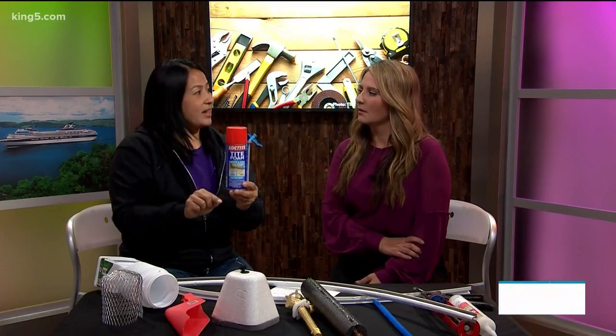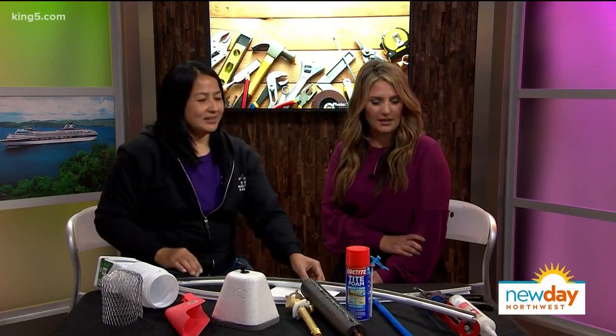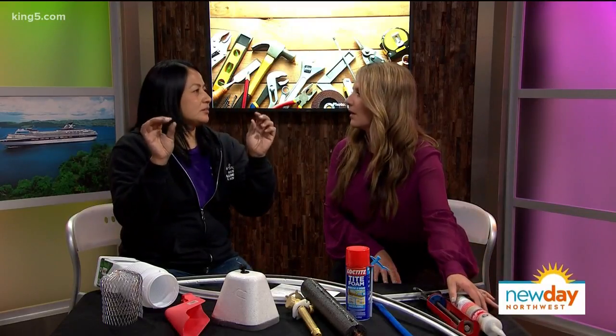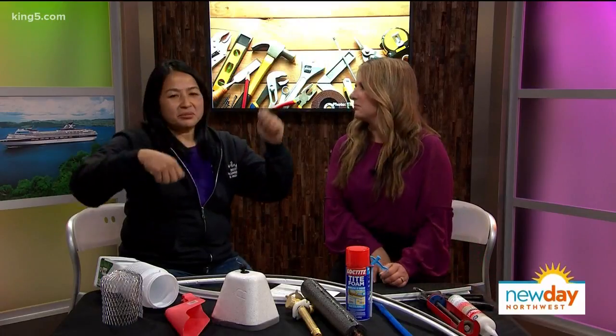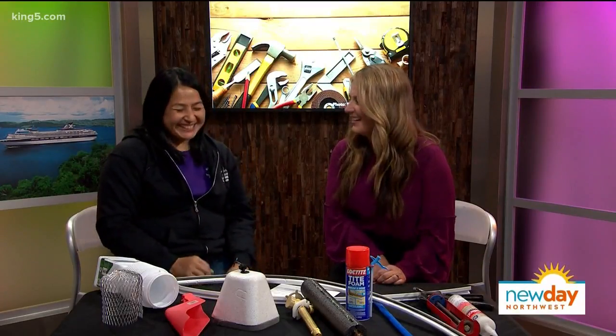When it comes to windows, a lot of the time cold breezes come through. Taking out the molding from the inside and putting spray foam in between the cracks will prevent that breeze from coming in. Not only is it more comfortable, you're also saving energy and money. And there's caulking — you could walk around the outside of your house and look. Most of the time there's caulk around the seam and molding that will shrink or deteriorate over time. Just remove the old stuff and put in new caulk when it's not raining. You better do it now — that will help you winterize your home.